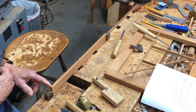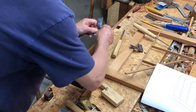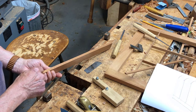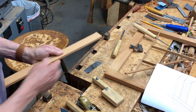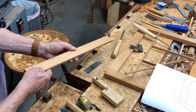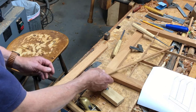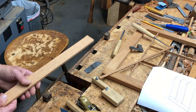Now I'll do that on this edge, and then turn that mahogany over. That's 3/8ths thick material. I'll turn that over and create the same shaping. Here you can see that I've already done it on the other side. This is ready then to slice off a 3/16ths shape, and then I have two straight molding pieces just like that. I think I need five or six of those straight pieces to do each door, and it's done pretty quickly.